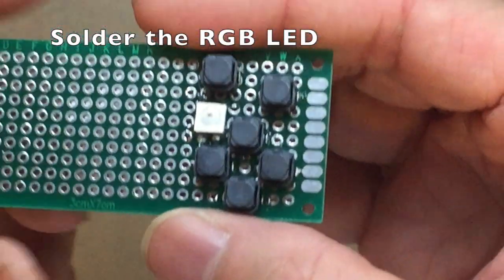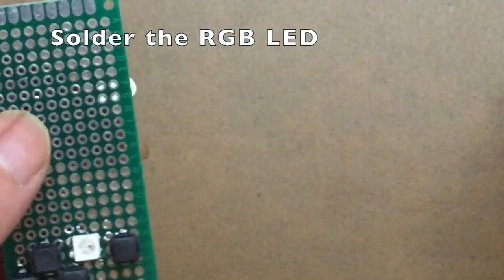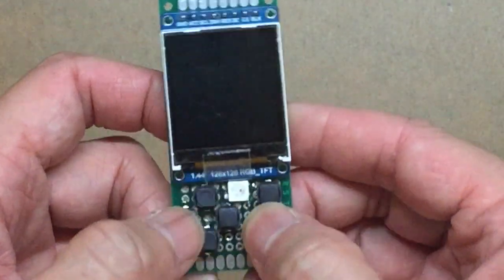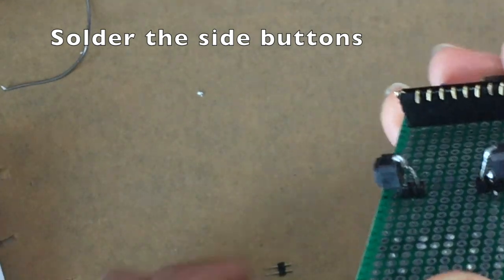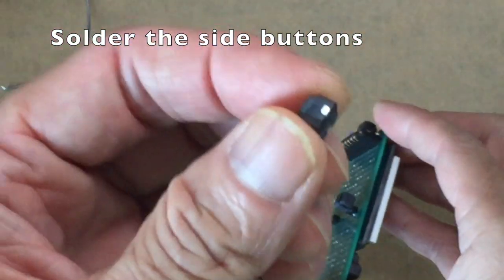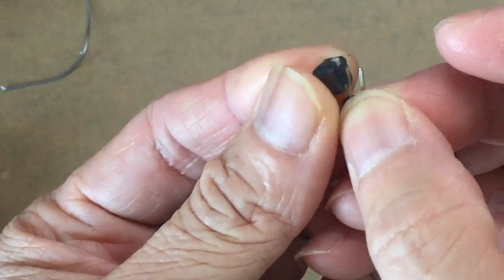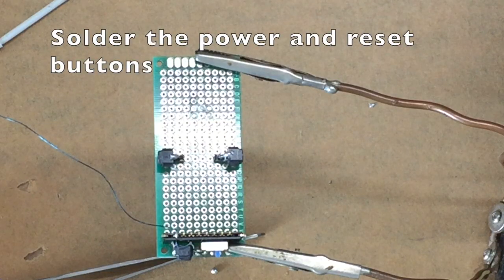This is how it looks after soldering. I also soldered in the RGB LED — there are four connections for it. We put the TFT back to do some fitting tests, to see whether we can operate it smoothly. After that we can solder the side buttons — there are two of them. The way to do it is: you have this pin, you need to bend it a little bit, then solder it to the two connections of the button and give it support so you can press it firmly. Next, we solder the power button and the reset button just next to the TFT pin connector.